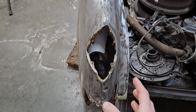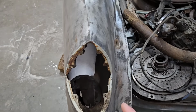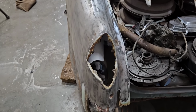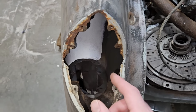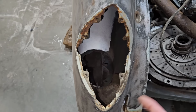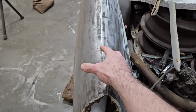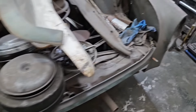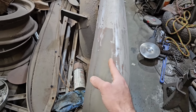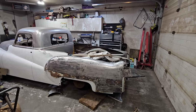Of course, the other reason why we're not just welding this on top, as maybe you can see already, is this Cadillac fin or taillight or whatever is substantially larger than the Chevy quarter panel, by quite a bit. So there's not really any way to graft this onto the top of here without having a weird transition or without having to remake the whole top anyways.